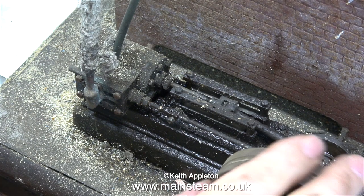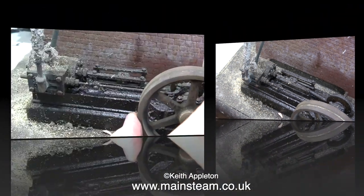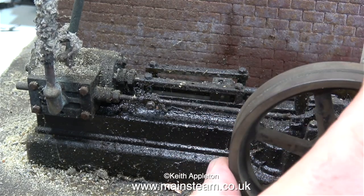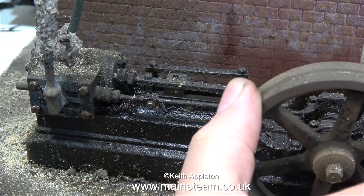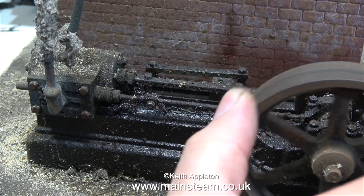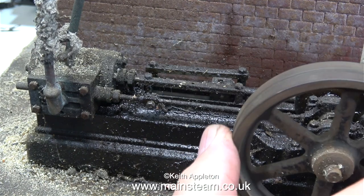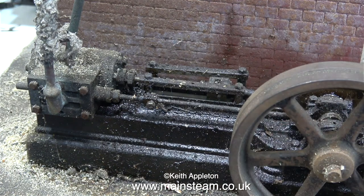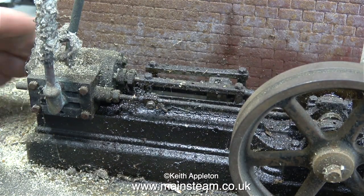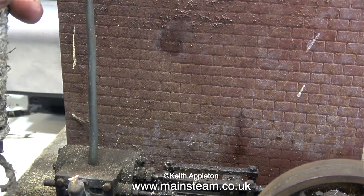Over the years I've repaired and rebuilt many model steam engines and I think this one is possibly the worst I've ever seen. The cylinder is loose but that's fairly common with S50 model engines. The initial problem I'm looking at is the fact that the flywheel only turns half a revolution and the piston locks up at each end of the stroke. Everything about this engine is horrible — it's quite an old S50. I can't see very much for all the filth that covers the engine: the old oil, dust, and grime. So I think the first thing to do is to clean it up.